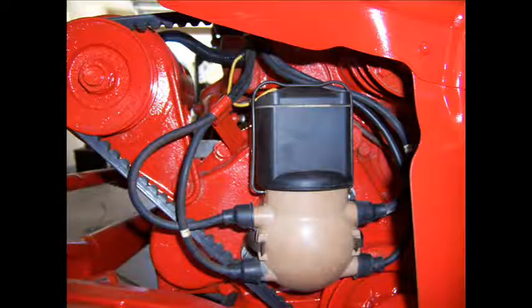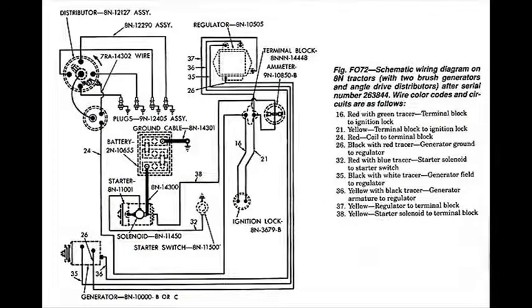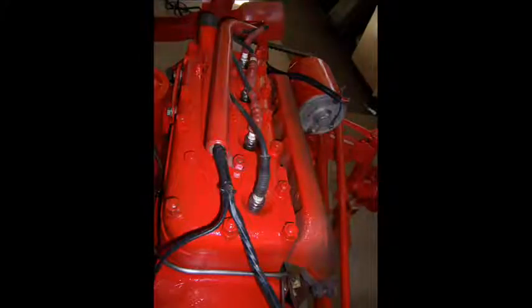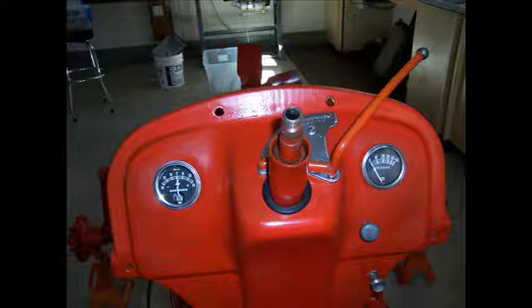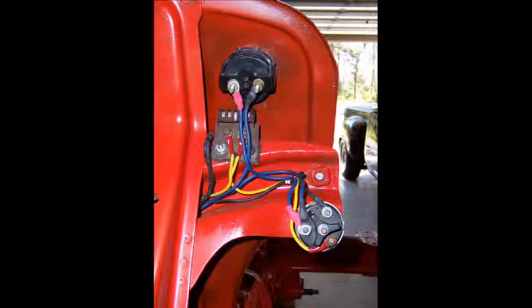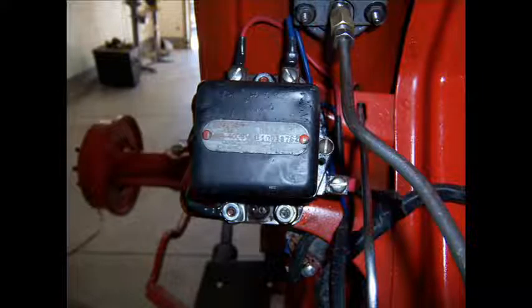Electrical was next — big issue with the electrical, though it's a very simple system. Here's the electrical diagram for both the newer and older model 8N tractors: side-mounted and front-mounted distributor. There's the front-mounted distributor with the wires run up into the tube, spark plug wires on the spark plugs, and then the wire run out the back of the tube to the console dash. Here's the generator — look at the extra wire that goes to the front headlamps. Look at the dashboard with everything mounted: choke, headlights. I polished the solenoid valve and then wired it in. Here's the amp meter and the ignition switch which I bought from Walmart, and a dropping resistor for the coil. Here they are all installed. Here's a side view of that same installation on the left-hand side of the tractor, voltage regulator on the right-hand side.